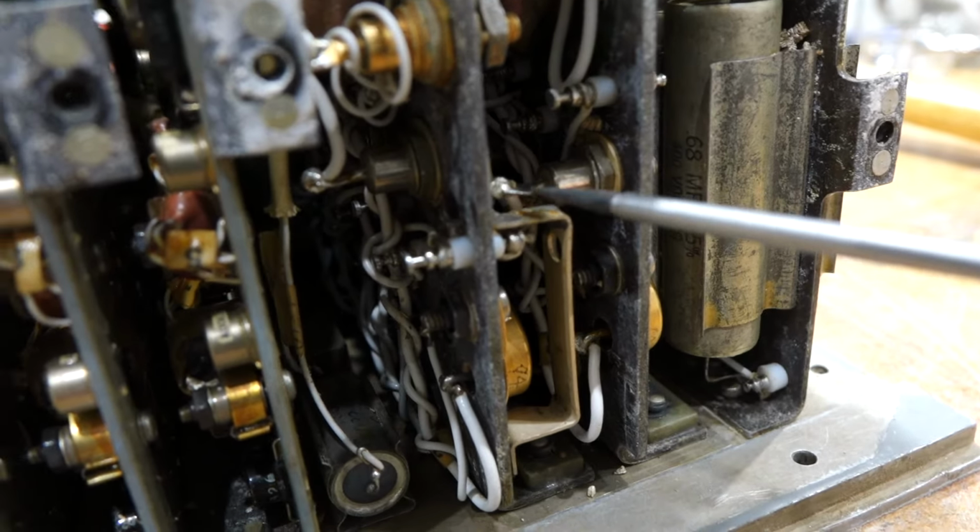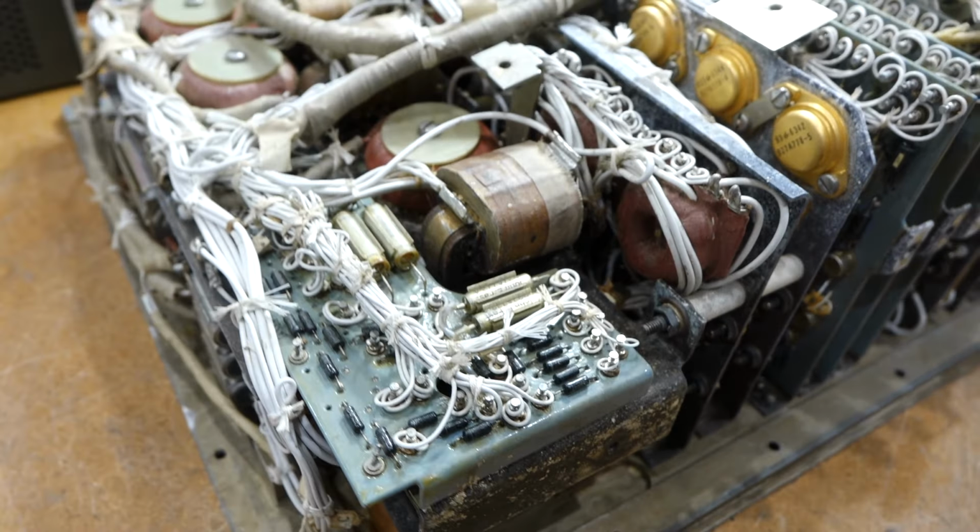You have 3 of the same thing here. These guys are actually not transistors, they are diodes. There are only two connections to it. This one is left floating, and this is true for a lot of them. So that's on purpose.